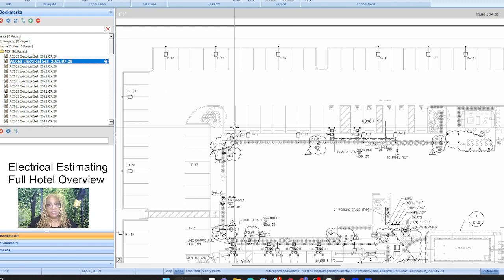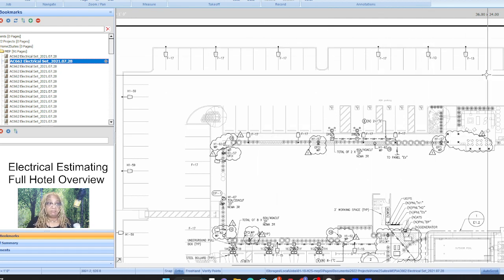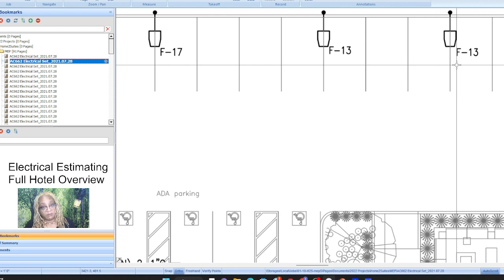Because again, you're not trying to give 100%, it's this much, you're trying to give an accurate representation. So if you were to do it that way, you're always going to add 10%. So if you do it in a logical way, you're never going to be off enough to say, oh man, I was so short, or too much can happen, right? Because these are naturally going to flow together. You're not going to do each one separately. That's why they give you the subscripts and the panel number and the panel name, and the subscript on the panel to let you know how they're run.